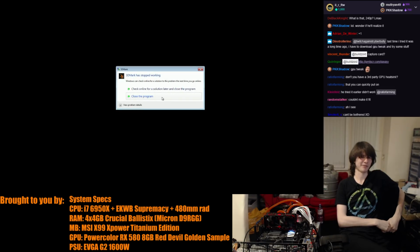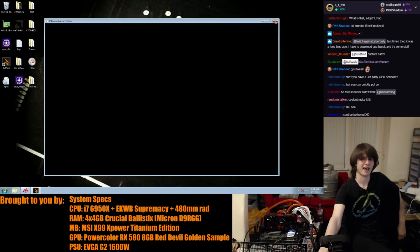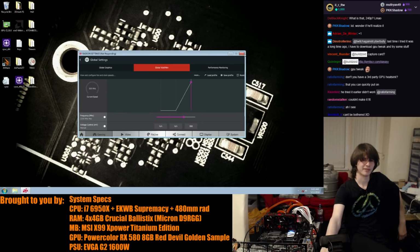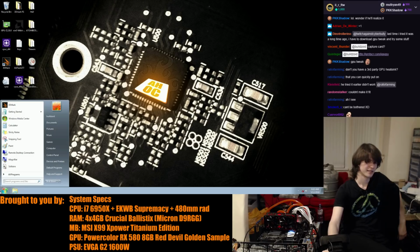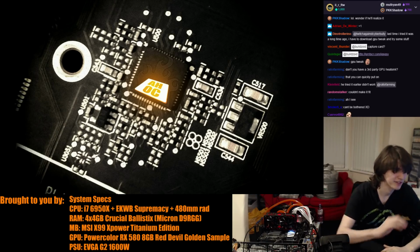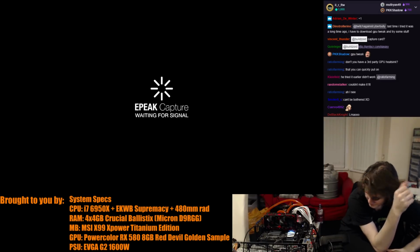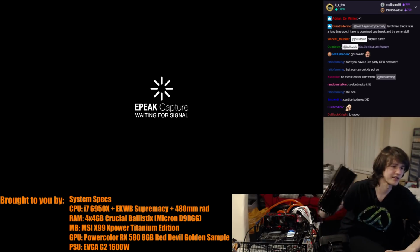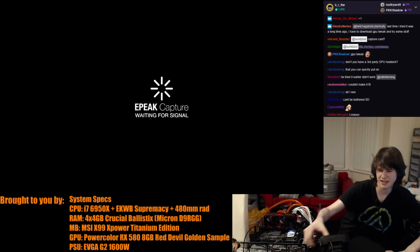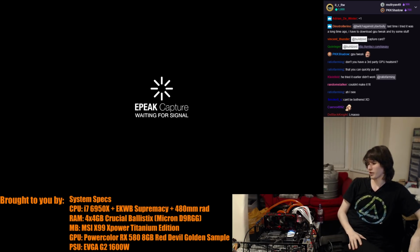Okay, I'm going to say the memory is now royally screwed up, because that does look like a memory problem. It looks like the 1500 megahertz timings are a bit too aggressive. It's not that the third party cooler wouldn't work, it's just you'd need to remove the backplate, and there's no VRM cooling. At that point, I'm just like, that's too much work, I don't care.